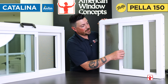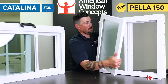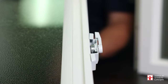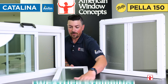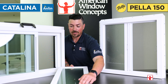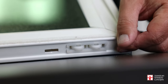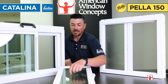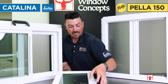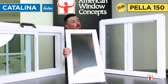Now you have obscure glass on this particular window only because this is made for a bathroom — this one here is just a sample window, so it's a little bit different. Here's your locking mechanism. On this lock, it is a pull tight style cam lock, and it's actually kind of strong — I like this. The weather stripping here is decent — not the worst, but not the greatest either. You have some nylon to allow for stopping more dirt. The roller system on this is going to be a little tandem system — it works out, but it's going to be basically plastic. The other thing is the grade of glazing bead — this is just a regular snap-in, there's no durometer. This is very typical of a lower grade window, but this will get the job done.